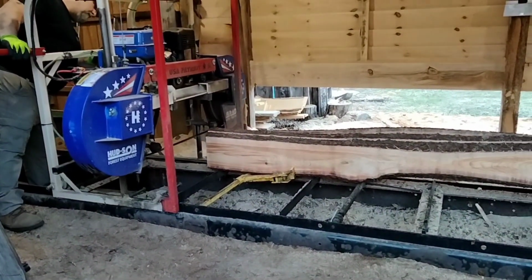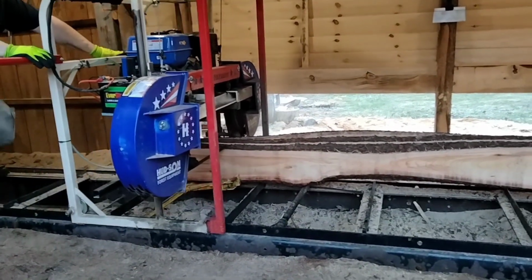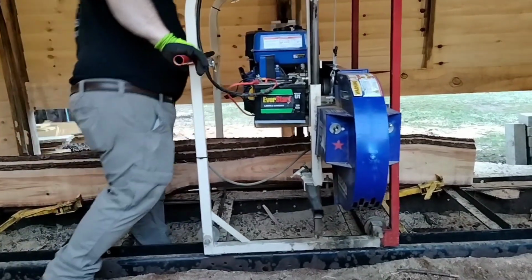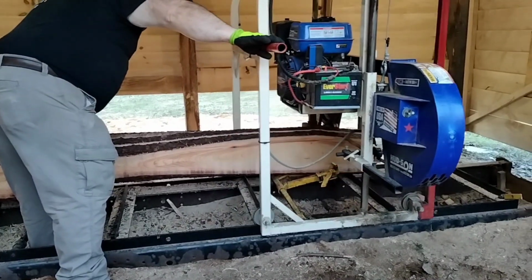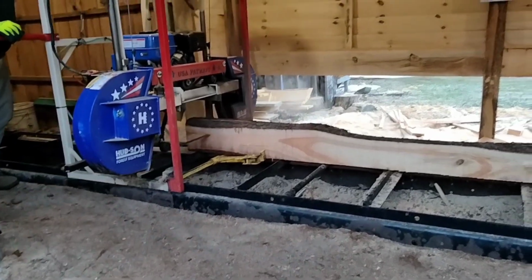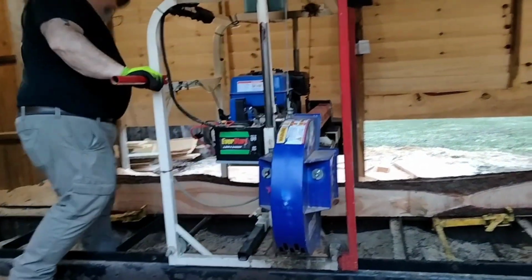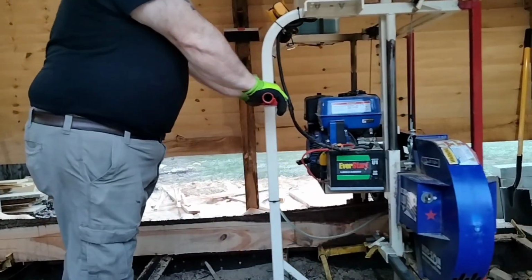Okay, as crooked as it was, this little log has been a little kinder to us than the first log. So far we've got 15 1x4s out of it without bark, and now we're going to cut the flitches. It's very fortunate for us that this log produced a lot of flitches. We weren't able to get an 8 1/4 inch cant out of it, but the flitches that come off will ride, so that will give us at least 2 1x4s per flitch. That'll be nice.